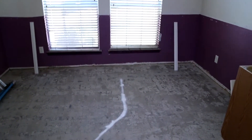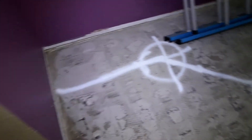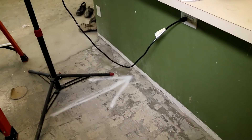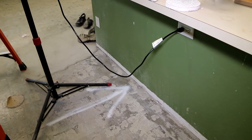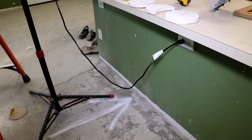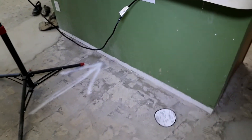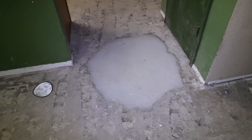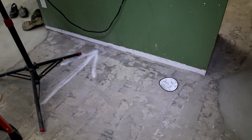They're tunneling from the front of the house following the line. There's one break there, one break in a 45, it comes underneath, and then there's a break further along — the riser coming from the sink has popped. Instead of drilling through the foundation like the foundation company did, the plumbers chose not to roll the dice with the post-tension, so they're tunneling underneath the house. I'll show you later.